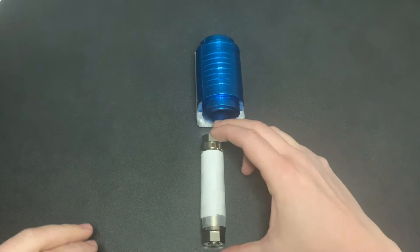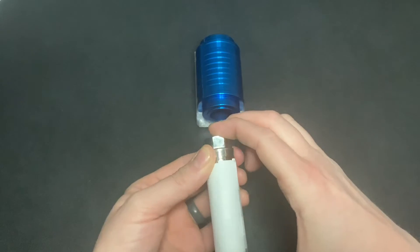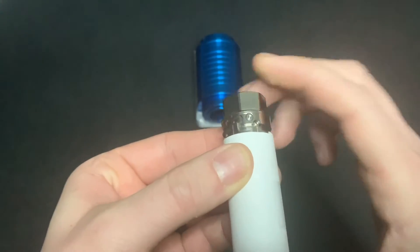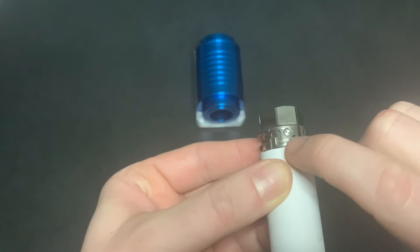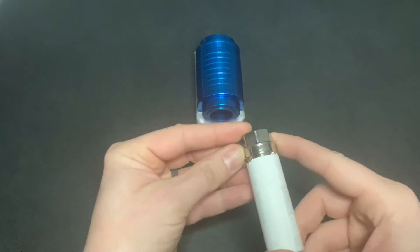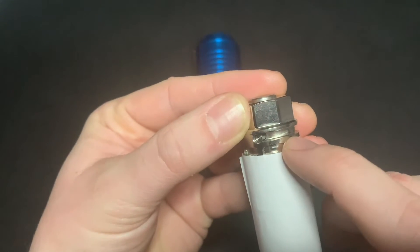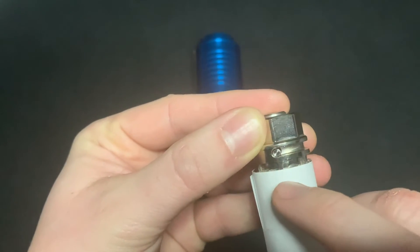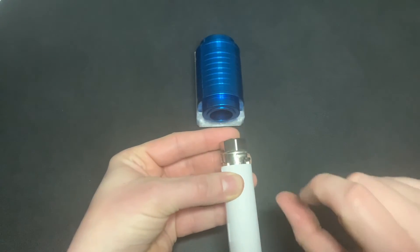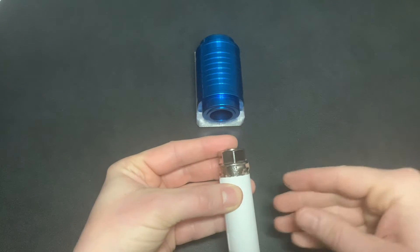I've removed the core and covered up most of it. When I turn 90 degrees I'll try to put my fingers over the pins. The first pin you'll see — there's nothing around it, so this pin actually holds in the draw bar. That one will come out later. Then this second pin is the pin for the maze. You can see here the path that gets deep enough for the pin to drop in. For a newer maze, sometimes I'll take a fine-tipped Sharpie — like a blue and a red one — and mark the ends with a different color for each pin so I know which orientation it's in.